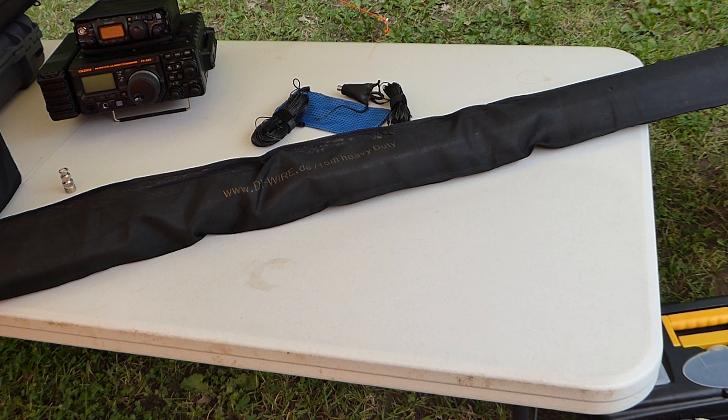Ideally, a dipole antenna should be a half wave or higher above ground for best results. Of course, a half wave on 80 meters is 120 feet — there's no way I'm going to be able to put up an antenna anywhere near that height. For my installation today, I am going to use my new DX Wire 15 metre telescopic fiberglass mast as a support for the feed line. I acquired the mast from Ron at High End Company in Holland. Note that the term 15 metre in the pole name refers to the height of the fully deployed pole, not the 15 metre ham band.